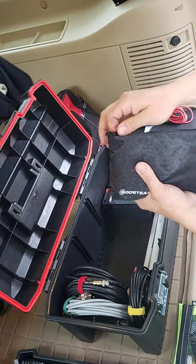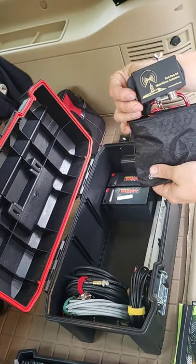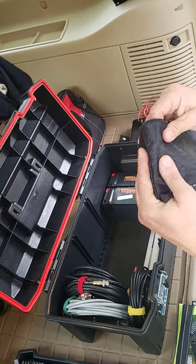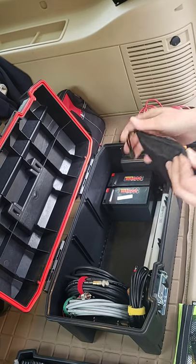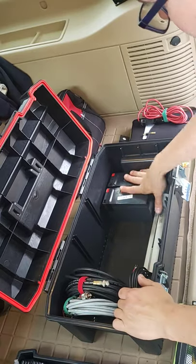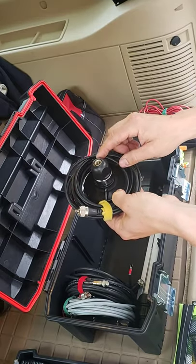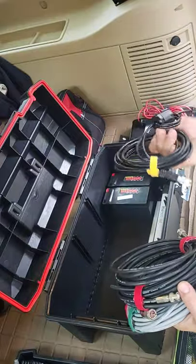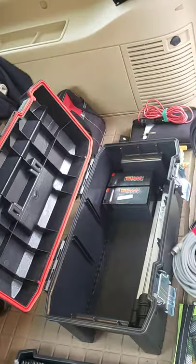Here is my Yorachi antenna — it's in a little bag with an HF matchbox. The Yorachi is made by the Honolulu Amateur Radio Club. It's about 30 feet of wire and I put a little counterpoise wire in there. This is a very good antenna for portable operation and very easy to throw up with that rope. I've got my two batteries and the mag mount I use with the Moonraker on the vehicle. I've got coax — a short piece and a 50-footer for the Yorachi, which they recommend you use.